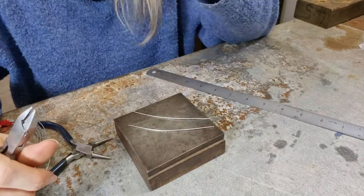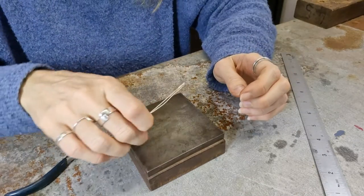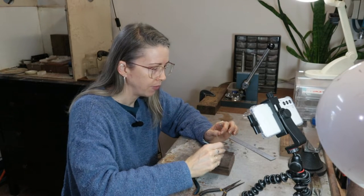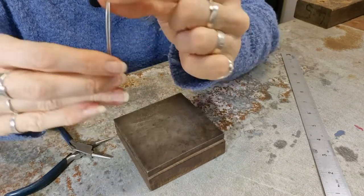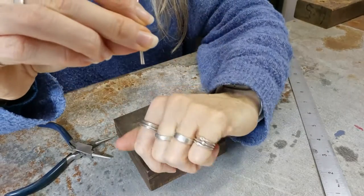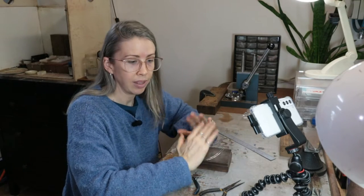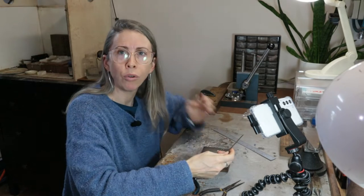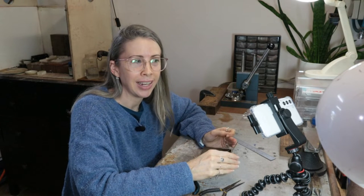Put our silver out of the way. Now you want to check before you start that these two pieces are indeed the same length, as close as possible. What I do is tap them on here, squeeze them up together and look at them to make sure the two ends match as much as possible at both ends. Then it's time to smooth the ends - I use a relatively rough file at this stage to get rid of all the jagged little pieces on the end.